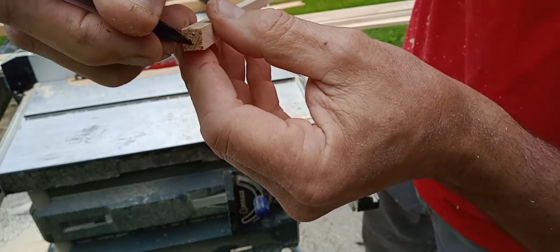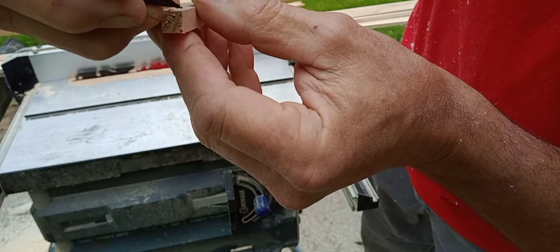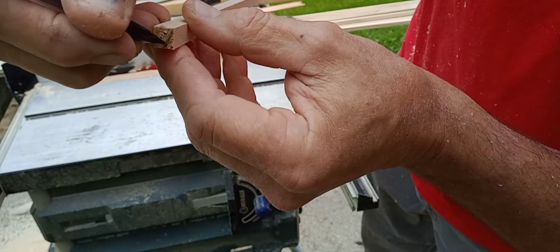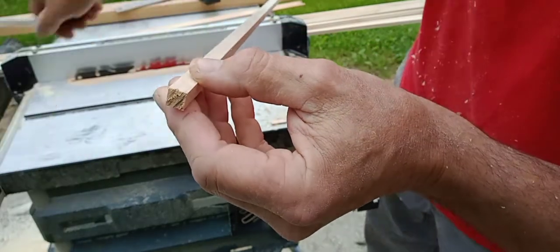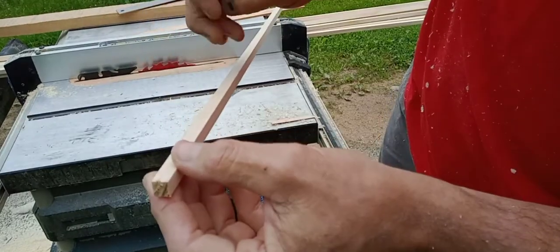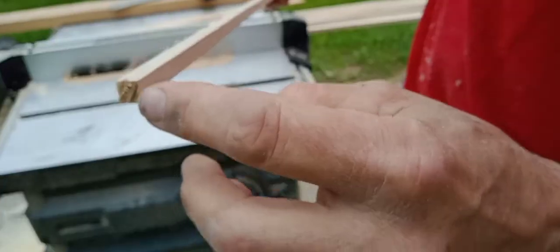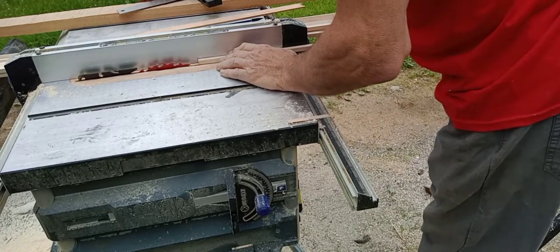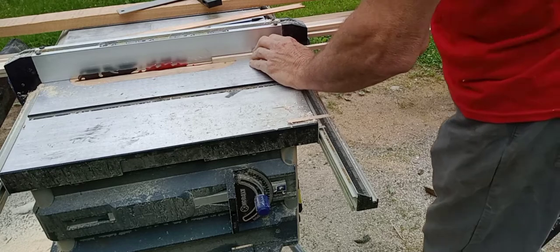The first cut we're going to make is a 24-degree cut, almost along this line right there, and it's going to come up to this corner right here. On this one we're measuring to the top corner — we're cutting about an eighth of an inch off, up to meet this corner. This is the bottom piece that runs the full length, uncut, on top of the rib. It lays on top of the rib and runs the whole length of the aileron spar web. This is the spar cap. And that's 24 degrees. The way I'll get this measurement is I'll bump it in until my eyeball says it looks about right, then run it into the blade a little bit and see where it comes out on this top edge. Don't forget to lock your fence down.